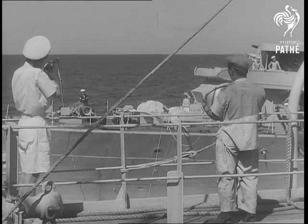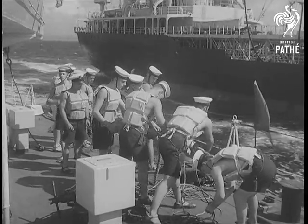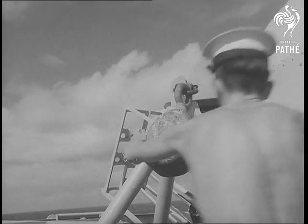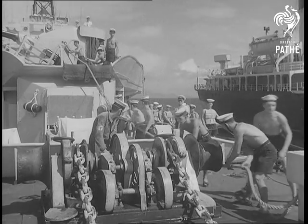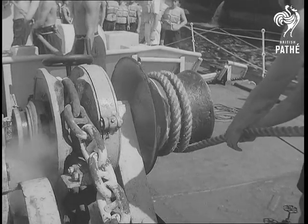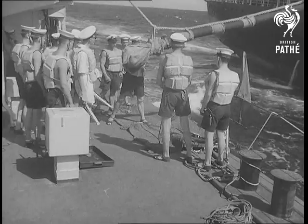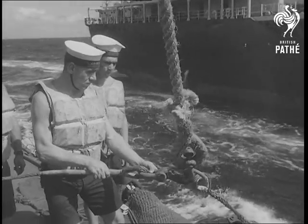To pass the gear, the gun line is fired from the supplying ship. In the receiving ship, the gun line is hauled in and the messenger comes to hand. As soon as the hose line comes to hand, it is unclipped from the messenger, roved through its leading block and taken to the windlass or a winch and hauled in. The outer length of the hose with the male unit of the self-sealing coupling is thus hauled into the receiving ship until the pennant in the receiving ship can be hooked to the ring of the pennant on the hose.